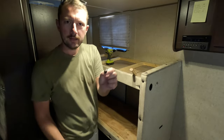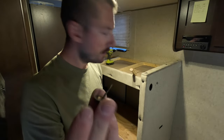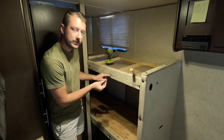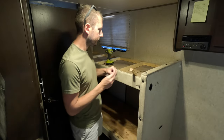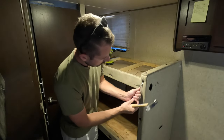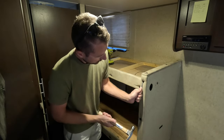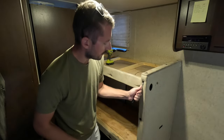If you have any little decorative buttons like this, they're actually just nail caps that are placed over top of screws in the wood. You just need to take a flathead screwdriver, get it just underneath there, tap it under there with a hammer, and then pry it off — just like you're prying out a nail.